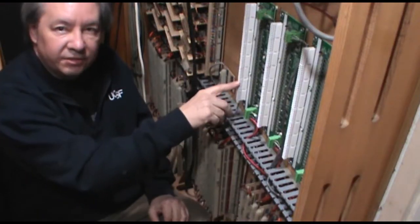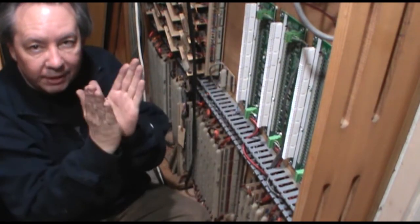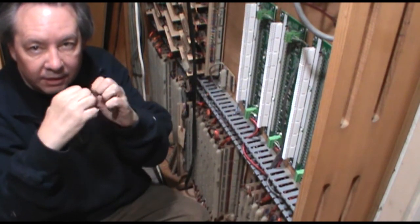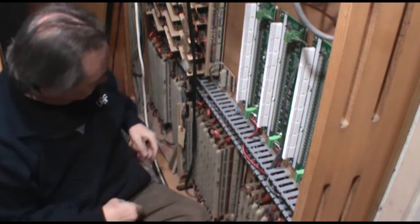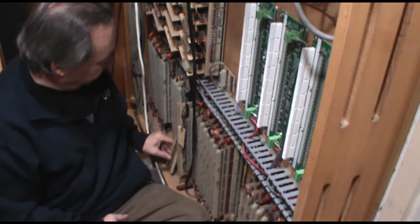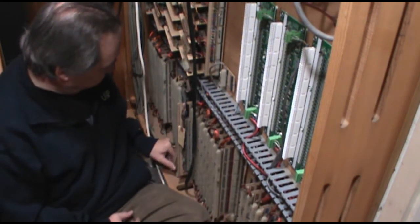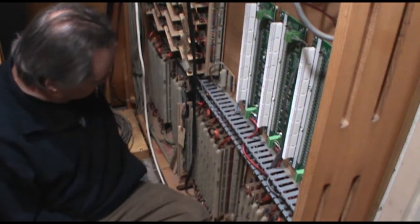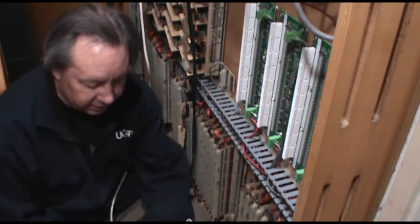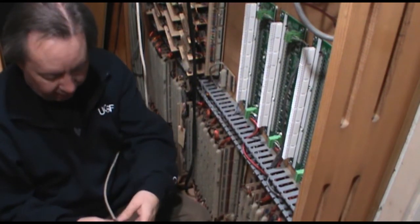It's kind of like a knife-edge thing — you shove the wire down in between the two blade pieces and it cuts into the insulation and grips the conductor inside. Then on the other side it's a regular twist connection. This type of cabling is often used in telephone systems. In this case I've got 12 wires, 6 pairs.